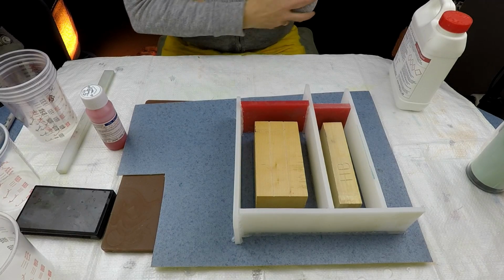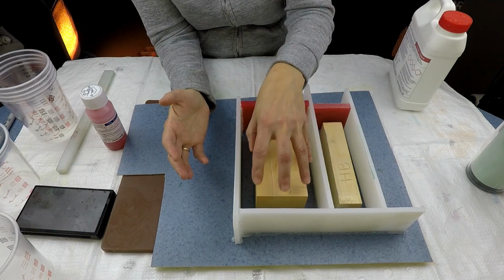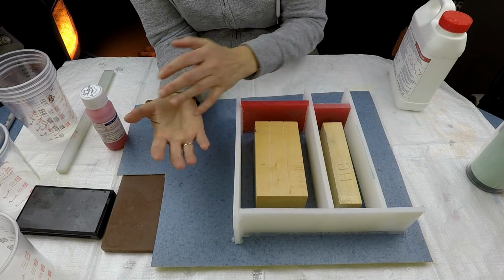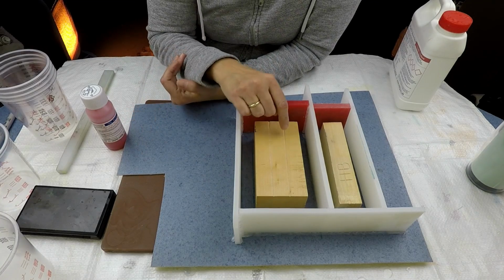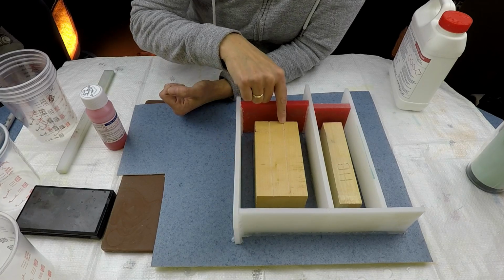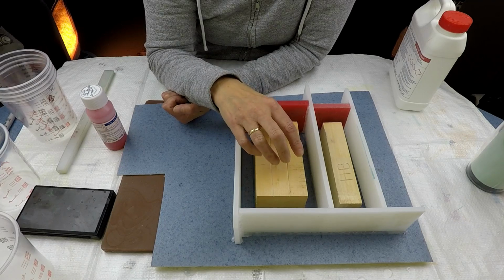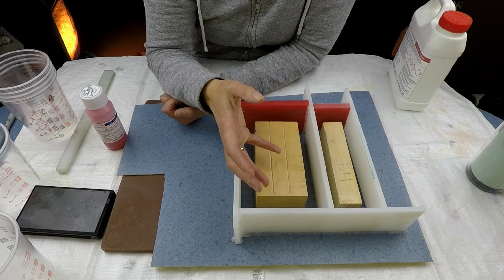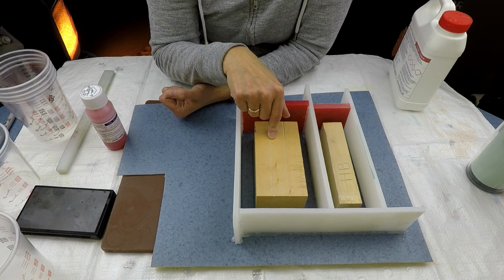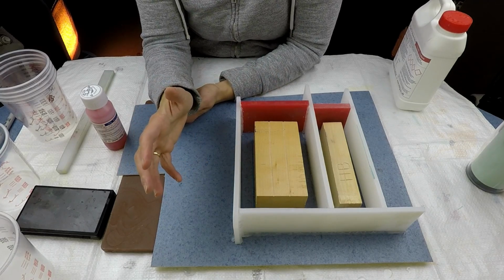pen blanks. So I just wanted something that was a little bit smaller, possibly, that I could cast more in, and I could use thicker chunks of wood and stuff like that in it. So what I did is I just used carving tools and measured this all out, carved little grooves here. And the idea with me doing that really is when I've made the mould and I use it for casting, these lines will be in it so that I will be able to take it straight to the bandsaw, and I'll have the lines there ready to cut down to size.